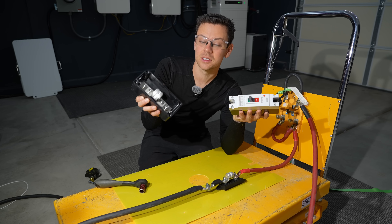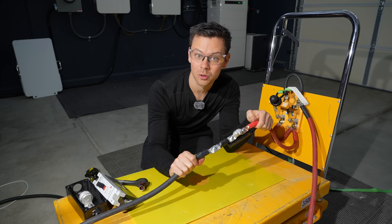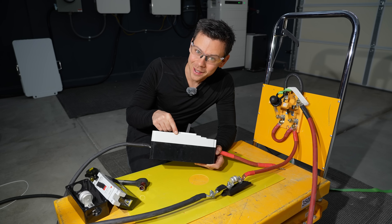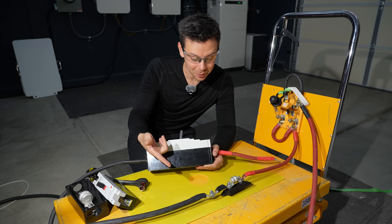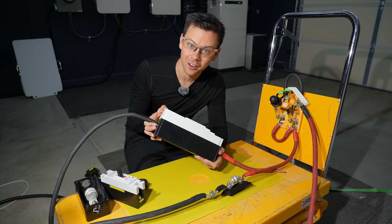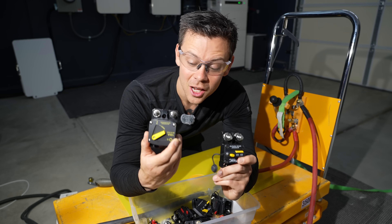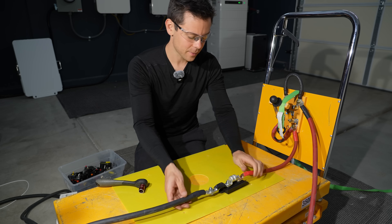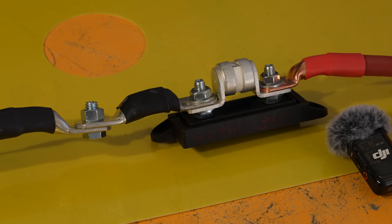MCCBs and T-class fuses have a breaking amperage capacity rating of 20,000 to 25,000 amps, but the small T-class fuses are only rated for 10,000 amps. Before we do this test, I realized if we cannot trip this one with a 30 kilowatt hour battery bank, we're not hitting the breaking capacity of any of these. It makes for a good show because we have a massive arc and the inrush is pretty massive — I bet for a millisecond it's a few thousand. But to create 20,000 amps that will continuously feed into that arc is almost impossible with these small systems. These have a much lower limit like 1,000 to 2,000 amps, so these might actually fail because 10,000 amps is very hard to create. But let's test it anyway — this is still a very strenuous test.